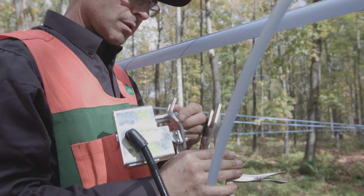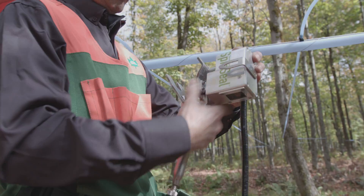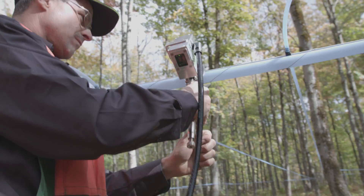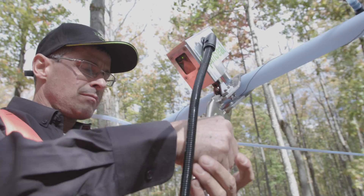Insert the fitting on the SpinSeal welder, making sure that it is fully inserted. Position yourself on the mainline at the desired location and squeeze the SpinSeal's clamp until you hear a faint click. This indicates that it is properly attached.